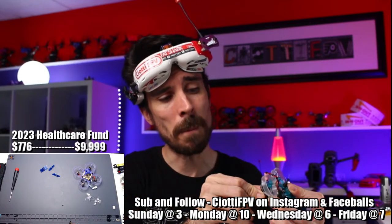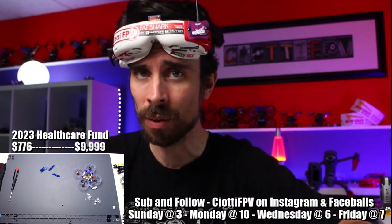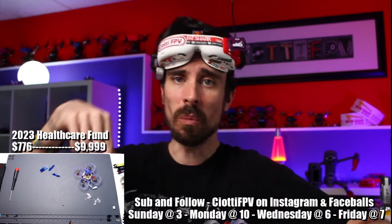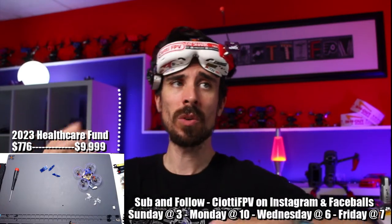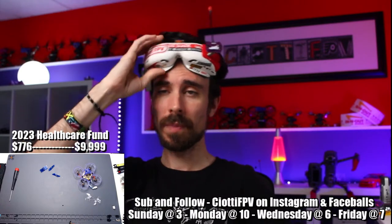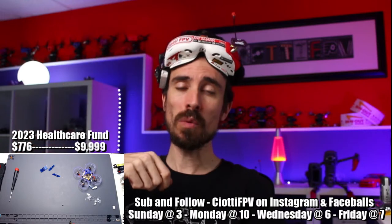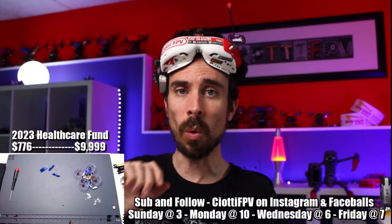So I'm actually going to back the PIDs off a little bit to get it to quiet down when it's at zero throttle. What you were just hearing there, and you can do this test with your own quads, just bounce the throttle up and down. What you want is for when you drop the throttle all the way down, the motors should come all the way down and be very, very, very quiet.